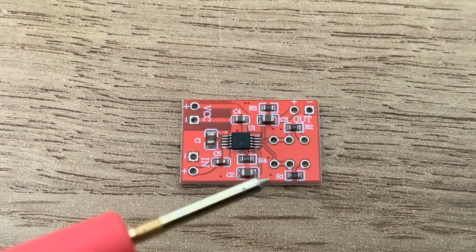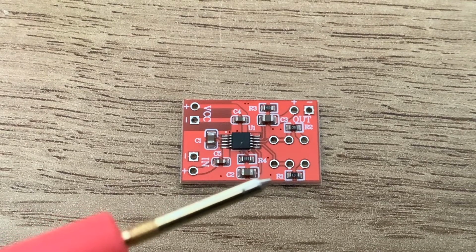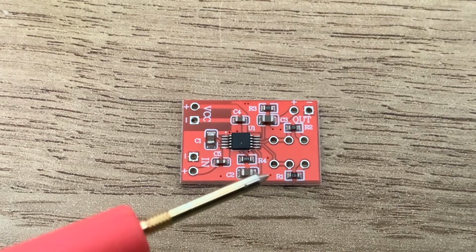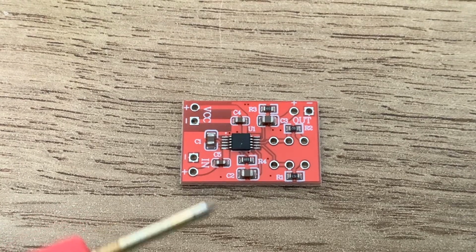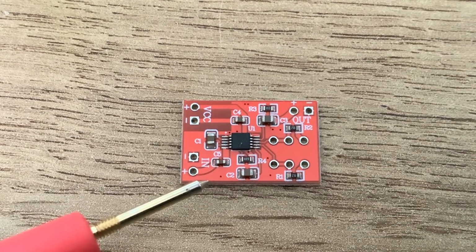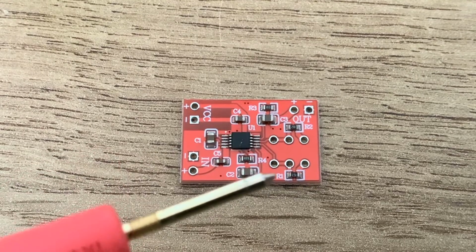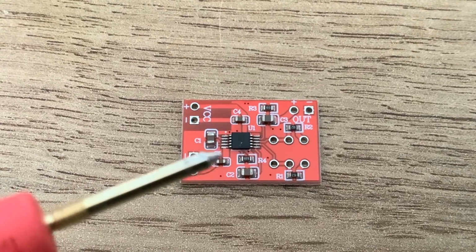But as it is, Dave actually did some research on this and some measurements, and realised that as it is, this thing is doing no compressing at all. All it's doing is limiting. And I've actually built a couple of transceivers using this as it is, thinking I'm getting compression, but never actually testing it, assuming that it's going to do what it says. But the truth is it doesn't, because, I don't know how this has happened, but every board that I've had of these, I've had a few of these now, so I've tested them, and they're all the same.